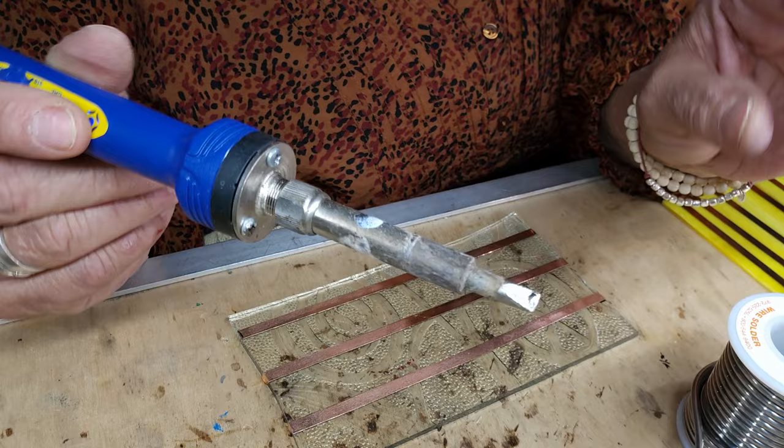There's a lot to learn in decorative soldering — there's technique, there's iron control, solder plays a big part. There's several different kinds of solders. Some people use 50/50. I use silver gleam for my jewelry and that's expensive. So you really don't want to mess around — you want to be confident when you do your jewelry because the silver gleam is so expensive. You don't want to have to wipe it all off and start over again. It's just too expensive to do that.